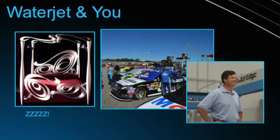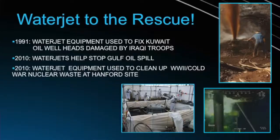So you probably don't have a wild, crazy bed like this, but one of our customers does a lot of artistic work and they cut this bed with a Waterjet. You can do all kinds of intricate shapes and designs with Waterjet. A huge machine that's 24 feet long, 14 feet wide, can cut parts that are as tiny as the white on your fingernail without falling in the tank. Basically, to keep them from falling into the Waterjet tank, you just use a little toothpick or something to hold it in place so it doesn't fall in.